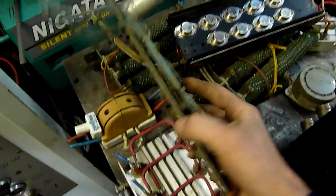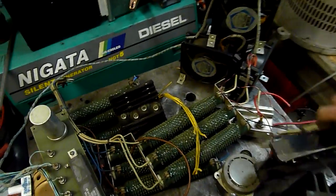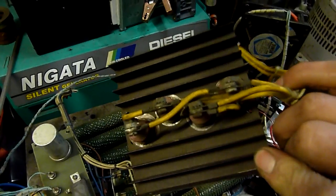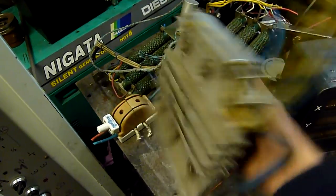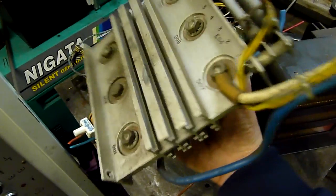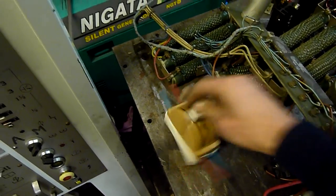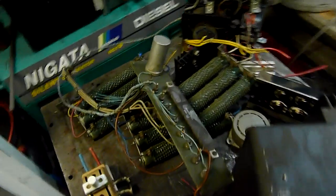We've got various diodes and the transistors I replaced in the back of it. We never really got much further than that as far as controlling the direct current - it did make a difference, but I think it only blew up more of it. There are just so many things wrong with this machine - a basket case really. That's a three phase bridge rectifier - that's the main DC feed for the electrode. Three blue wires come off the transformer, and there's one negative and one positive output. There's a big knife switch with plastic shields - that's for polarity changing; you could change between positive to the table or negative to the table and vice versa for the spindle.